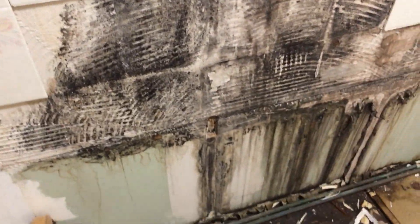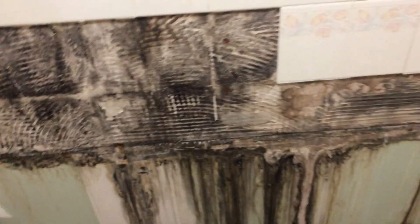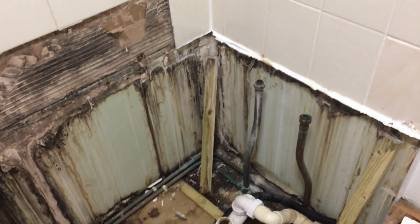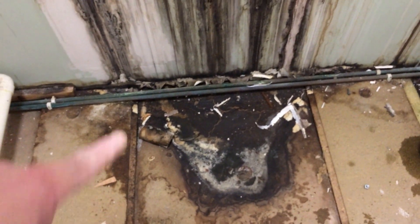That's the bath out, but there's a little host of horrors here. I think I'm going to have to contact the property agent - I think all these tiles are going to have to come off, or at least up to where we find the mold. We'll see what sort of condition they're in. I think we need to get some new plasterboard in there, and this vinyl flooring is going to need renewed - I'm going to put my foot through it. Yeah, this is totally wrong.